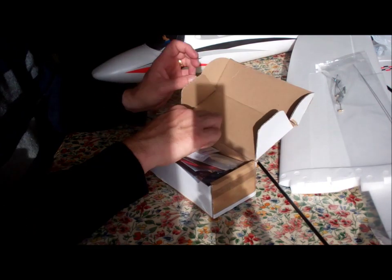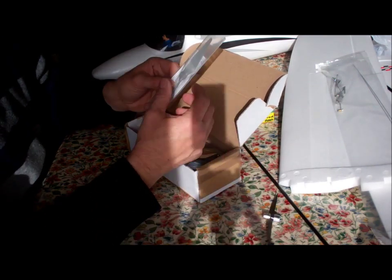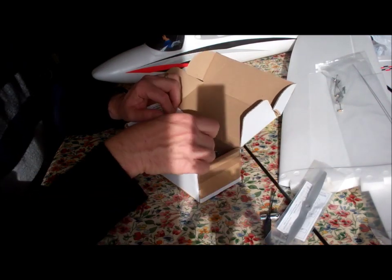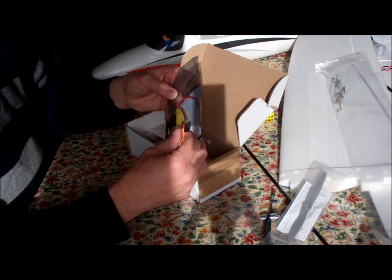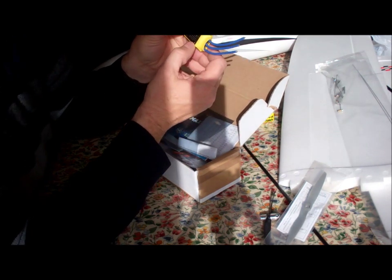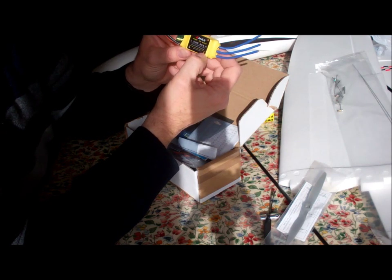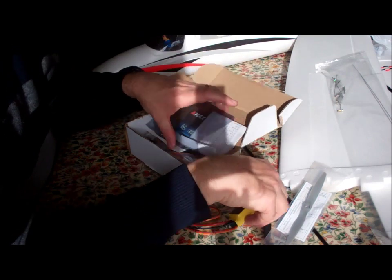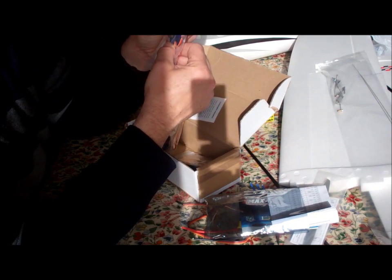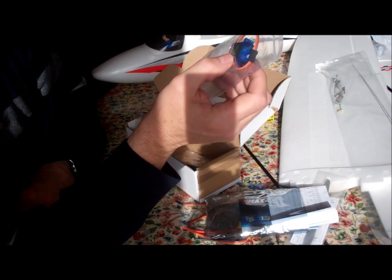Such a speedy service. You do get a propeller and an adapter with the plane, which I've put in here because obviously I've had it open. Also got a replacement APC 6x4E propeller. I'm using a 35 amp speed controller, so a little bit overkill maybe, but I've seen Bruce in Australia, RC Model Reviews, recommends you have at least a 3 amp BEC on here, so that's a speed controller. And these are the Tower Pro servos, SG90s. I got A grades because they're only a few pennies more, and for reliability.